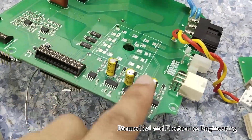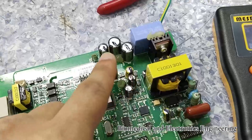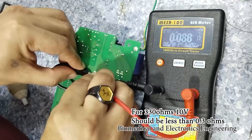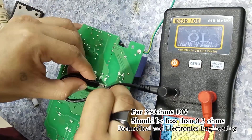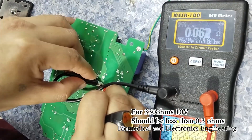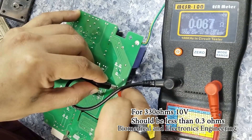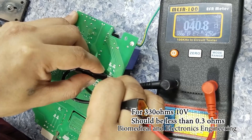Also on this one in the other board, we will start one by one. As you can see, we don't remove the capacitor — this is the advantage of using this ESR meter. So far so good, let's continue checking until we find any defective capacitors on this board.